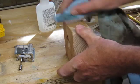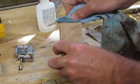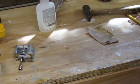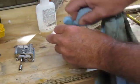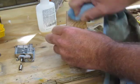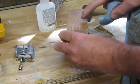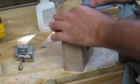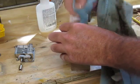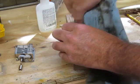And you don't want to just put one coat. So you put one coat on, and then you let it cure, and you put another coat on, let it cure. And with each successive coat, the darkness of the grain comes out a little bit more, and the oil soaks into the lightness of the grain and makes it a little bit translucent. So it's really pretty.